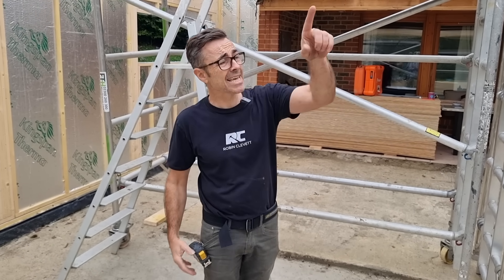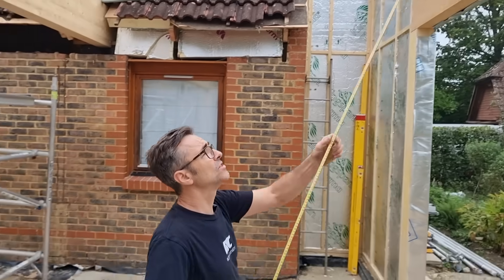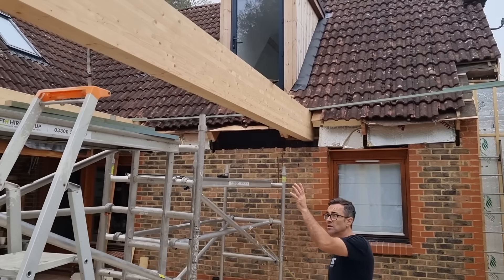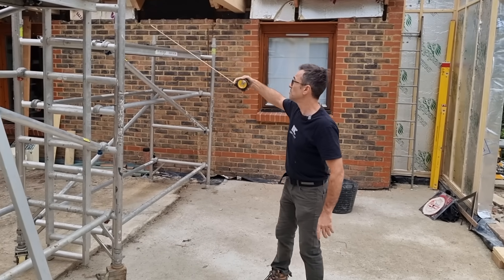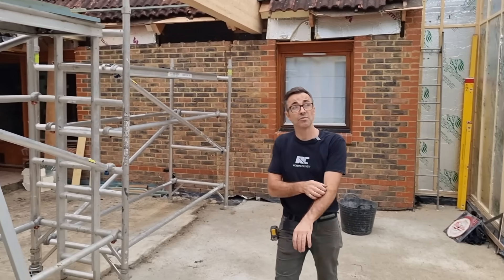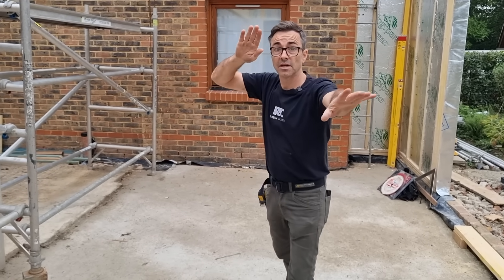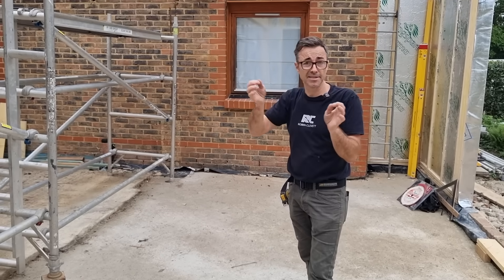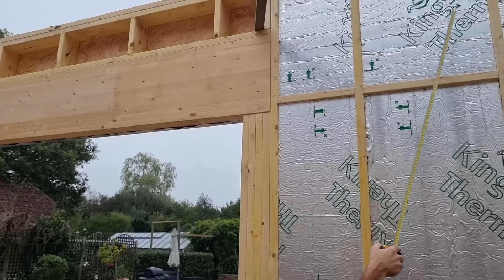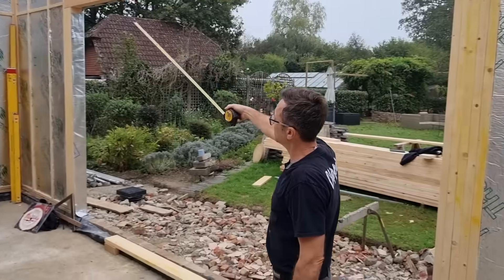What we're going to be doing is hanging between the glulam — from the front wall, where we've got a glulam over the top, we're going to hang glulam to glulam and then build out onto the slope of the roof at the back. When I set the building out I made sure everything was dead parallel, so all the joists coming through here are going to be the same length — we haven't got to cut anything individually. We'll have a couple of small timber bearing plates that come across the studs, so the joist will be less the thickness of that plate on each end.